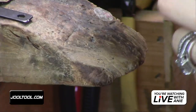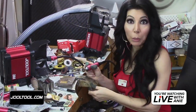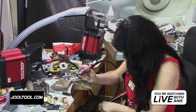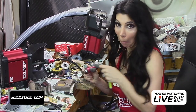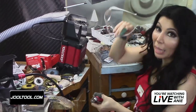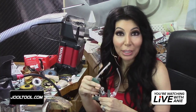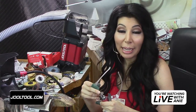So what I'm going to do is take my cutting wheel. These are great if you're lazy and don't want to cut with the saw blade, and you can't cut it with a cutter. Just be careful because they're very brittle and do snap and break. So I do recommend, if you're going to use these, I'm no joke, you guys, I would wear glasses. Just put on my cute little 3M glasses, not because of the particles I'm going to grind that come off, but because these separating discs break. However, I've broken probably 1,000 plus in my life, and none of them have flown at me.